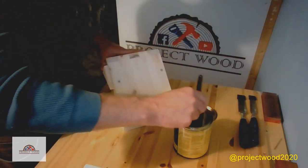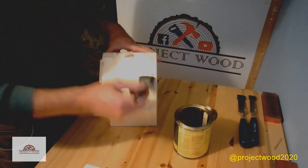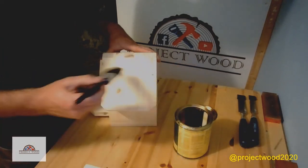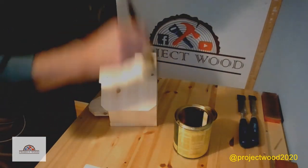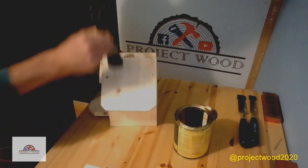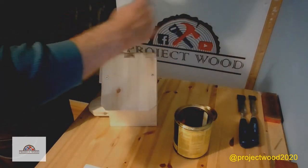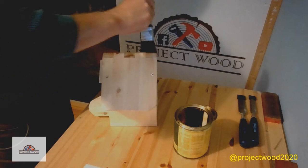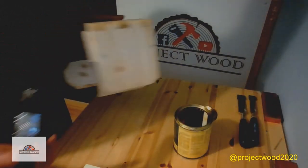So just make sure that you don't let anything drip over the ends. I always work from the middle out. This really brings out the grain on the wood. And just do this side, maybe the back, and you can have a look at it. So we'll work from the center up. Make sure you're not finishing off, splashing towards your eyes. Okay, and we're going to get a lovely effect here now on the top with the end grain. Round it off on the sander. Really see there, you get a beautiful shine off that and a nice effect on the end grain.